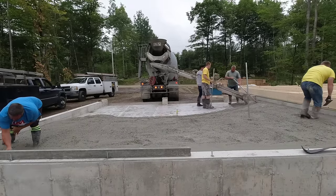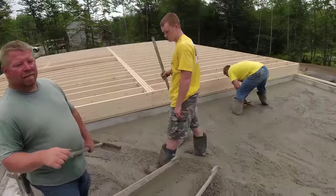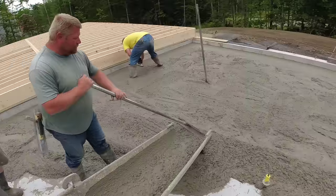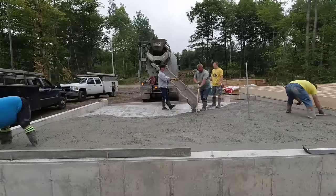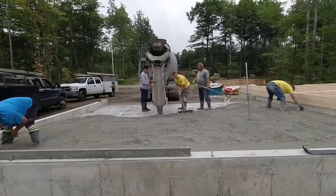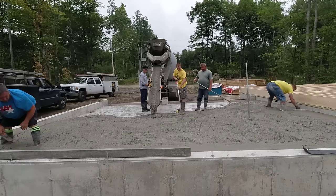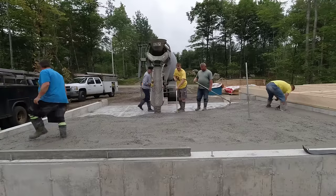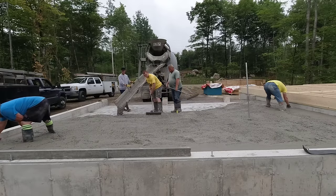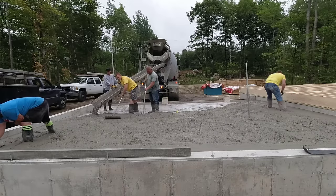Now as we get more poured out, Darren went back to mag along with Eric, so now we're getting two sides of the garage grade magged out as we get this poured. So two guys puddling, two guys magging, and me holding the chute. We could probably pour the concrete out of the truck just a little bit faster if we wanted to. Like if we were really going for speed we'd probably pour about twice as fast. But obviously that wasn't the case when we showed up today — it just worked out that this actually went down pretty fast.